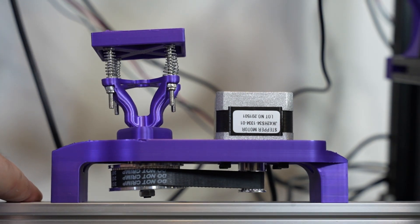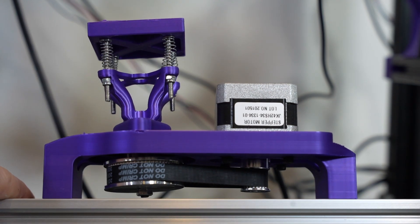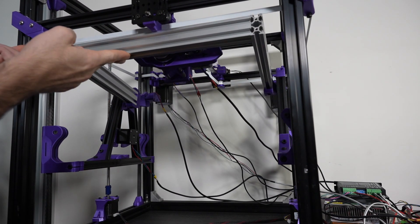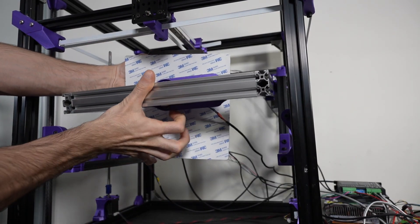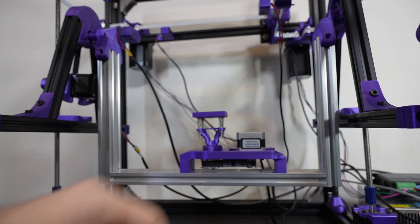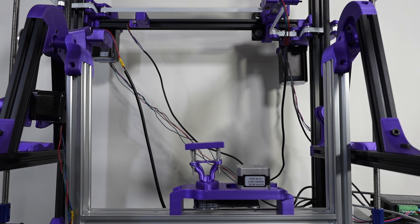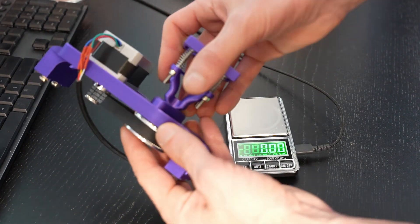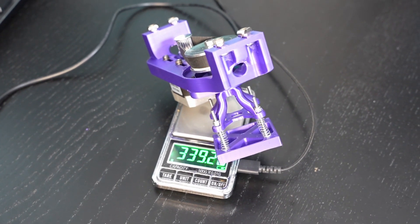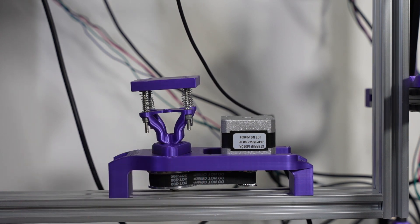Now onto the V-axis. My initial vision was more or less like this, but honestly I thought the entire assembly was going to be lighter and smaller, and not this ugly — I disliked this part as soon as I finished assembling it. The idea is to make the print bed smaller than a traditional one, since a bigger one would limit the degrees of rotation of the V-axis and make me worry about collisions way too early. This size of printing bed should be sufficient to try something. I also think this is another offender when it comes to weight efficiency and will drastically reduce the top speed of the printer. Let's test this setup as it stands, but I am certain I will have to modify parts of it. The pulley I used is actually quite heavy, and just by finding a better combination of pulleys and motor sizes I should be able to shed some weight.